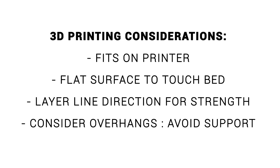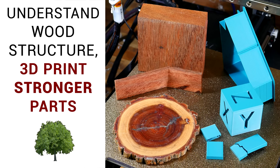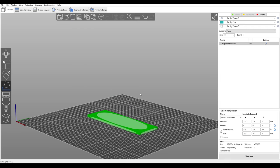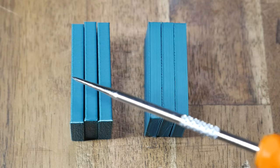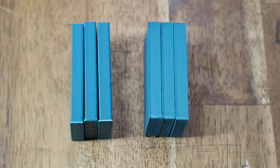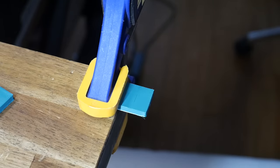So far in this series we've been revisiting this list of 3D printing considerations, and one of them is particularly relevant for this tutorial: the print orientation and therefore the layer line direction will dictate how strong parts are. If you're new to 3D printing, I'll link my beginner video about this topic in the description. In a nutshell, our layer lines will travel vertically up the object and these are the weakest link, so it's much better to keep objects low and wide for optimal strength.